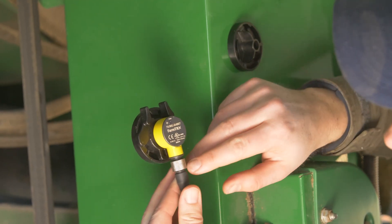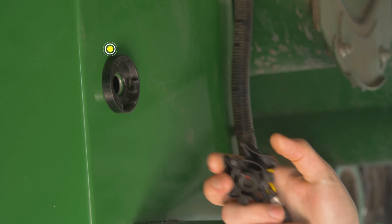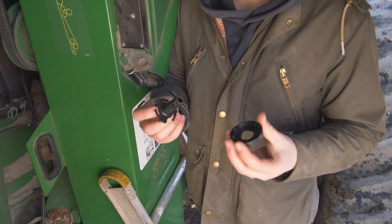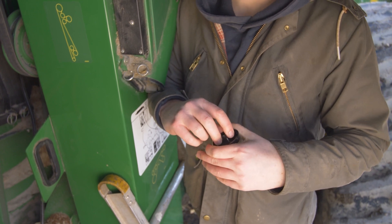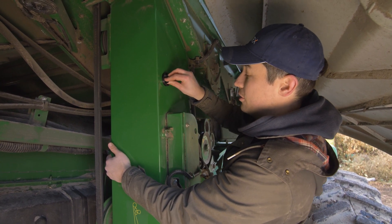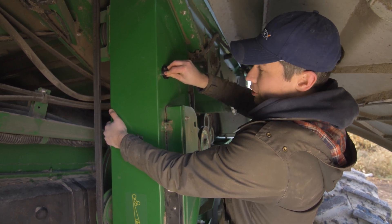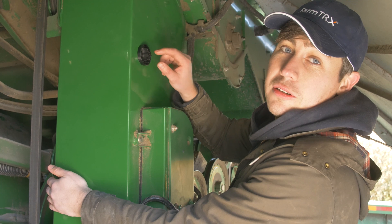Before mounting the plate, decide which way you want to route your wiring. You'll see that the wire leaves opposite each of these clips, so if you want your wiring to go this way around the elevator, set it up so that one of your clips is facing opposite that direction. Next, take the mounting plate and remove the adhesive backing. Once removed, take the drilling jig, place it into the mounting plate and twist it into place. Line it up with the hole using the alignment piece and press it onto the side of the elevator. Apply pressure here — the adhesive is activated under pressure. We suggest applying pressure for at least 15 seconds to make sure you get a good bond.